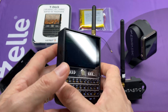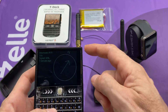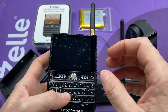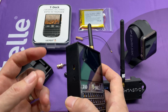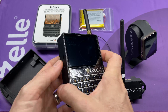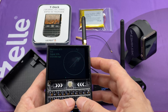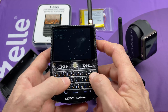This is an off-grid communications network because it doesn't rely on cellular, Wi-Fi, or Bluetooth. There's a 915 MHz LoRa radio inside all three of these devices that they use to communicate directly with each other. 915 MHz is in the ISM band here in America, which means you are legally allowed to operate in it without a license. You can also send encrypted communications, which Meshtastic supports out of the box. My favorite part is that you can get up to a few miles of range between nodes, so with a handful of very cheap hardware you can quickly deploy your own off-grid encrypted communications network with massive coverage area — and all of these are battery powered.